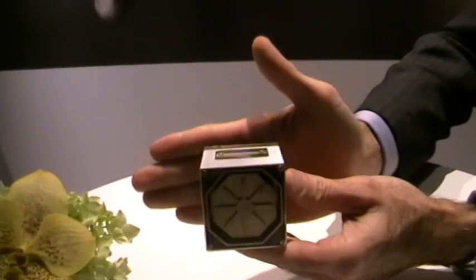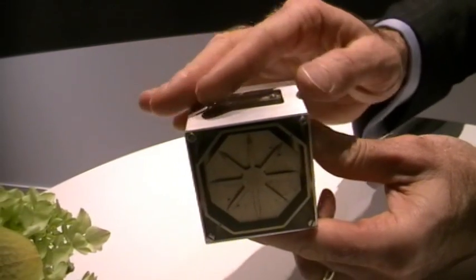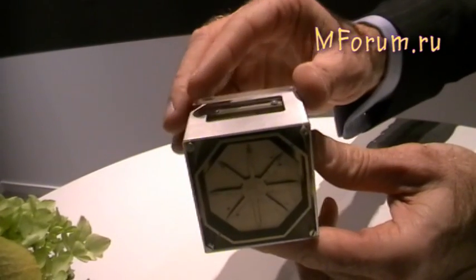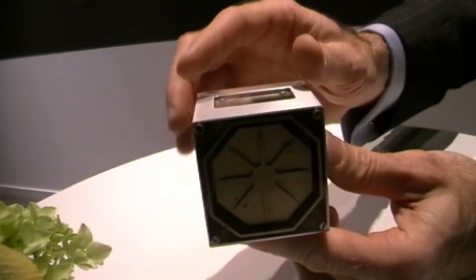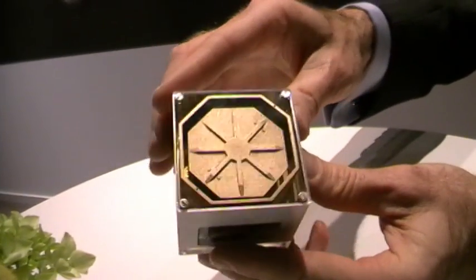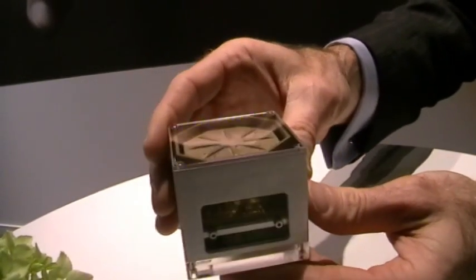These cubes are all connected to a backplane. The backplane has the connections and the power. It also is where beamforming occurs — the electronics drive beamforming. The beamforming will increase capacity of the cell by 30%, which is very important for an urban area where you have lots of users. If one of the cubes goes bad, you still have the sector — you don't lose service. And at some point, you pull it out and put a new cube in.